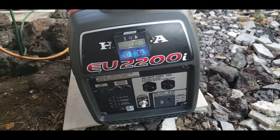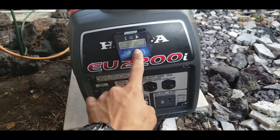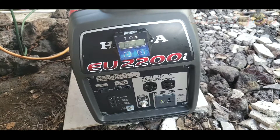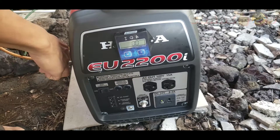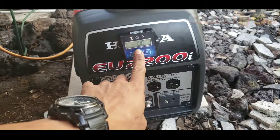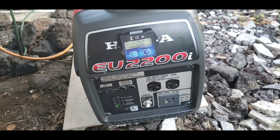To switch to hours display, press M, then in the PR setting press and hold S, then press S again until you see the hours option, and just leave it until the flash stops — it returns to hours mode. Let's start the generator — look how good this Honda generator is, just one pull start. As you can see, the hours are now showing.